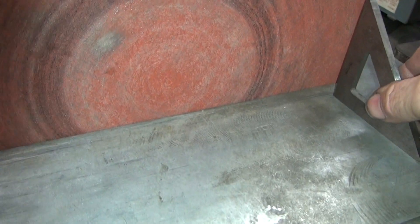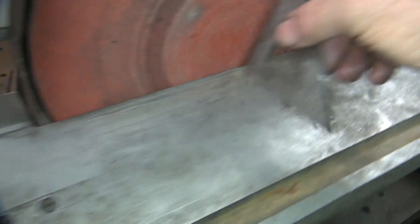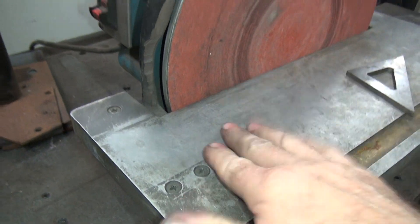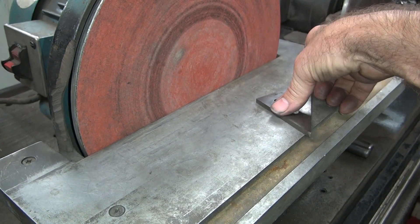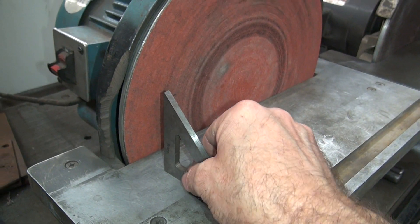When I'm over here on this side, it's pretty flat. But if you go over here, we have rock — see how it rocks. So this is curved, high in the middle, low on the sides. It's got a high spot I've got to get rid of. When I've got my block over here, it's not going to be flat, it's going to be angled.